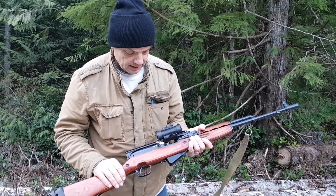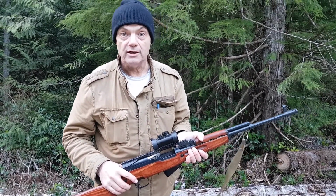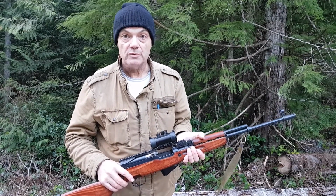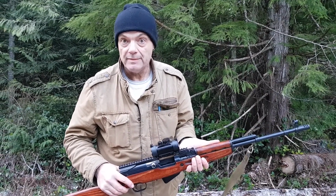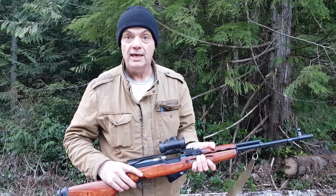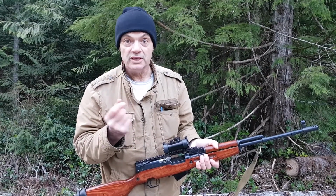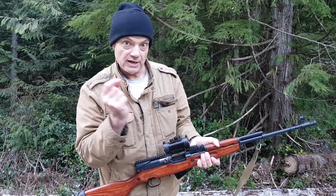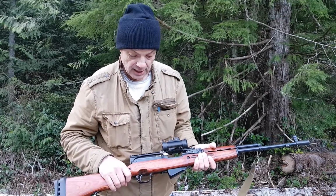internally I did a trigger job on it. If you look online on YouTube, there's all sorts of guys that have, including Iraqi Veteran, who's got one on doing a trigger job on them. And it's well worth doing. Like, it's not a big deal. I mean, if you don't feel comfortable with it, don't do it. But if you take the trigger assembly out, the biggest thing is the sear. If you get the sear out, and even if you don't shorten it, if you don't want to remove any material, just polishing the thing and the little rails it slides on makes a lot of difference for getting rid of the creep on the trigger.